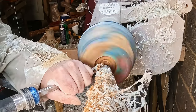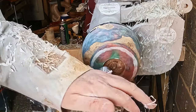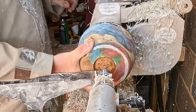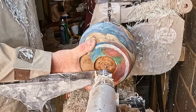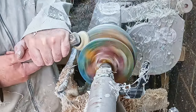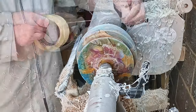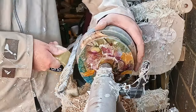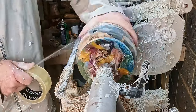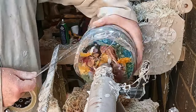Whilst doing the final cleanup, the chuck loosened its grip on the woodworm screw and the blank moved. This did some more damage to the rim - not much, but just enough so there wasn't enough material left to get a decent thickness to the outer edge. So after filling the holes in the lower section, I wrapped packing tape around the blank to form a rough mould so I could recast the top section. This would hopefully fill all the cracks and voids in one hit.